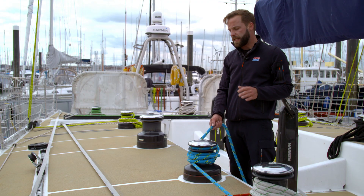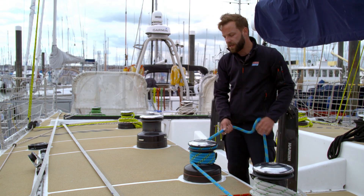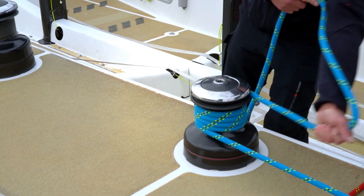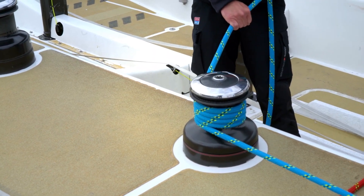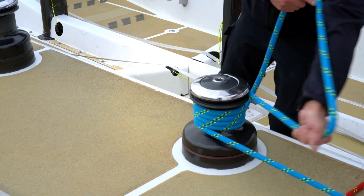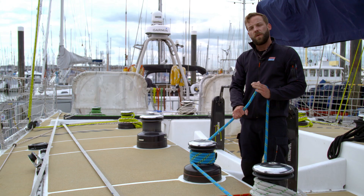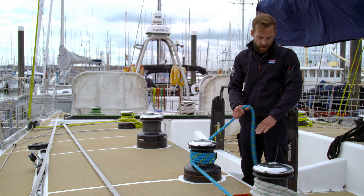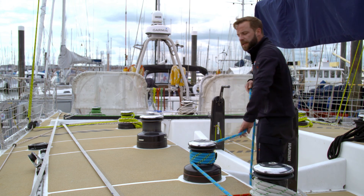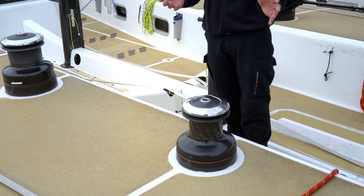The other thing you're going to do is let fly. When you want to let fly on a winch, take the safety turns off. Again, take it out of the self-tailer — remembering that this can be under a lot of load, so it's really important, as you take it out of the self-tailer, you keep this line under constant tension in your hand below the top of the winch. Once you're sure that you're ready to let fly — not stood on the rope, not caught around anyone's leg — you're just going to spin the turns off the top of the winch drum nice and quickly, and let the line go out.